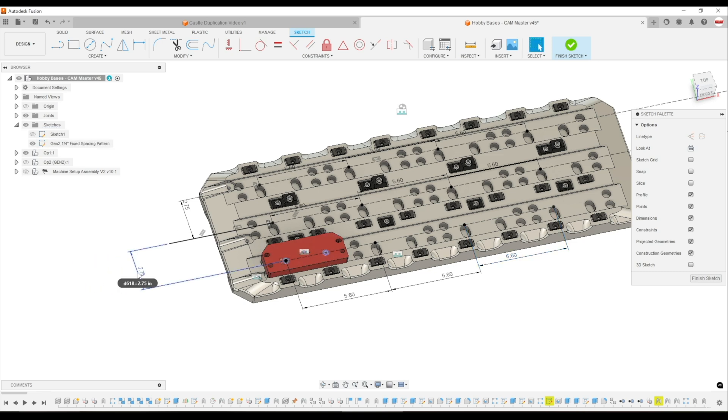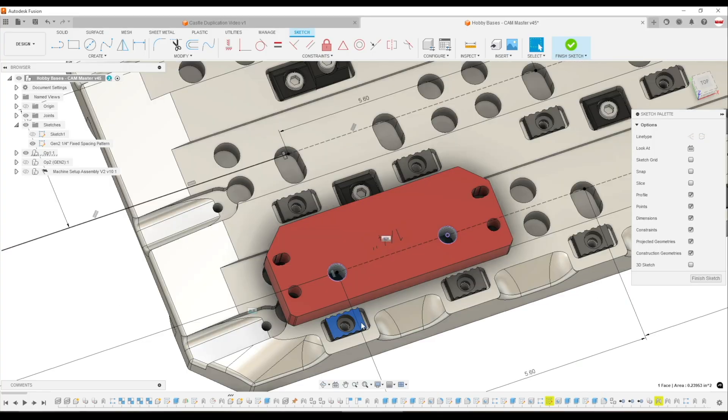This is an op one fixture out of aluminum extrusion with plenty of extra stock, so I don't anticipate ever having to adjust these dimensions. But there'll be an op two fixture behind it, and that op two fixture will be such that — for example, if I need to trim castle grip inserts and we end up moving that plane back 10 thou and want to shift the part over — it's easy to do that.